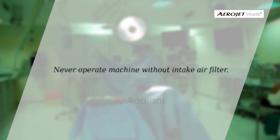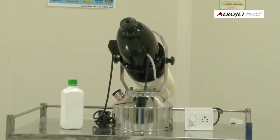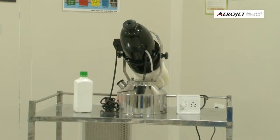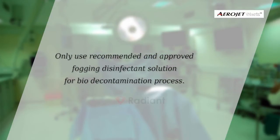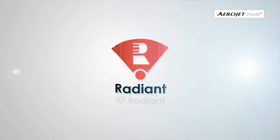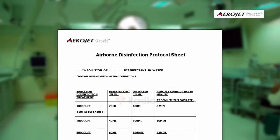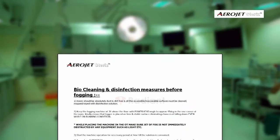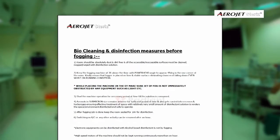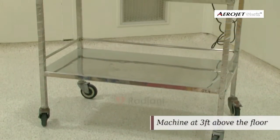High-speed motors of the machine should not be kept running continuously for more than an hour. Never operate the machine without the intake air filter. Our machines can be used with many leading environmental disinfectant formulations and brands. Only use recommended and approved fogging disinfectant solution for bio decontamination. Contact Radiant Enterprise for better understanding and guidance. Strictly follow the airborne disinfection protocol sheet provided with the operating manual to disinfect a given size of room, which clearly mentions preparation of disinfectant solution and duration of fogging treatment.